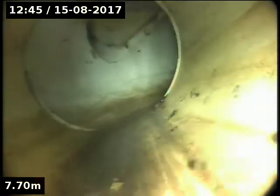Okay, we've just flushed that through, got some mud off the lens, heading outwards, I reckon that's your 45, mate. We'll locate that, just chase it back, but it comes straight to here, so we'll get just a bit of a shot back here. 0.3, so we've crossed over to where we were before on our junction with an IO at the start from up the main run. So all of this PVC is in pretty good nick.